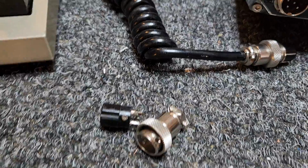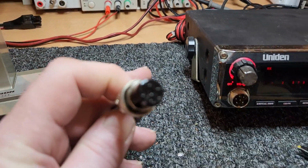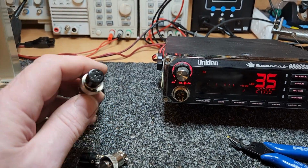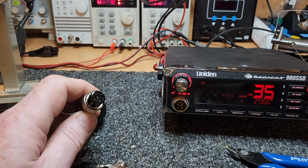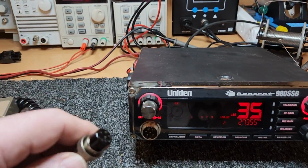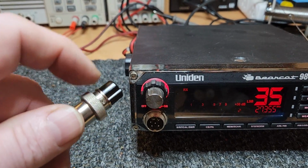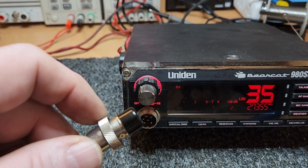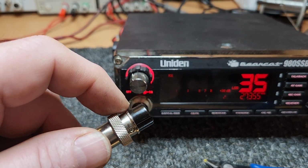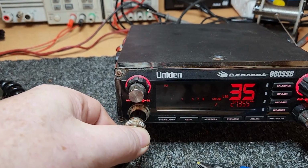Okay, so now we know the back shell fits okay, and I've tidied up all the wiring. All looks very nice and neat. The next thing to check is to make sure that when you put it all back together, it hasn't bent a pin over or done anything or is touching the outside of this here. And if you've got some sloppy soldering, that can happen. The round bit of plastic that was inside there, you slide over those contacts to make sure it can't get to the case. Often you'll find that's not there.